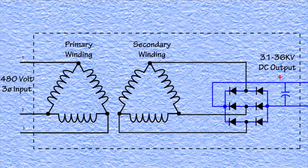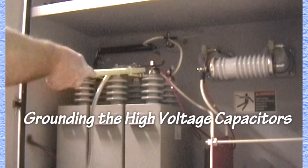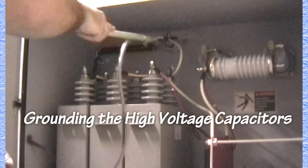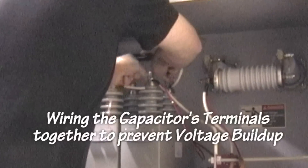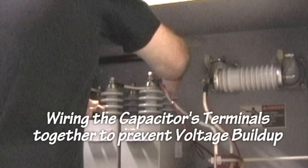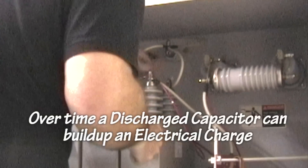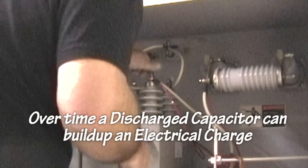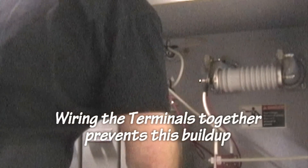Because we have a spare high voltage power supply from the analog transmitter, we'll remove the high voltage rectifier board from it first. The first step is to be sure all the high voltage is dissipated in the power supply — that means grounding out the capacitors. Next, the capacitor's terminals are shorted together to eliminate the possibility of an electrical buildup, which can happen sometimes. Once the capacitors have been discharged, a residual charge can build up — probably not enough to kill you, but enough to make you jerk your arm back and injure yourself.